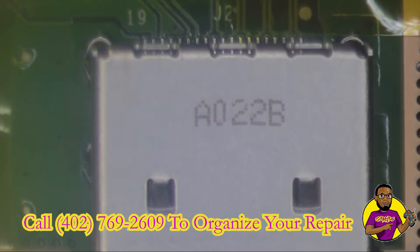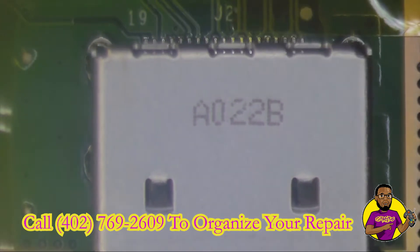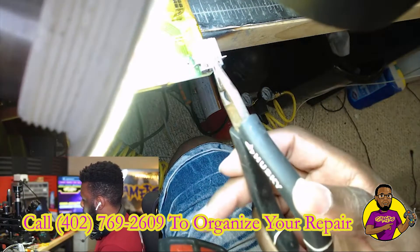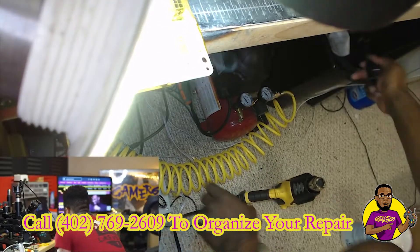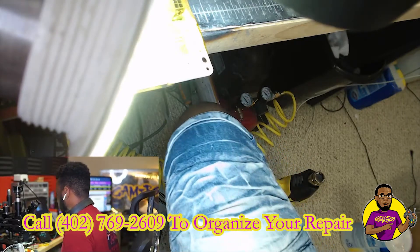I'm going to keep it under the microscope so I can see when that solder heats up, because if you take it off too early you will end up ripping off some of the traces, and that's a process to get back. All right, we got the HDMI port taken off. Switching back to the upper cam — as you can see I have it in the tweezers. I waited until the solder was hot enough to be fully melted before pulling it off.